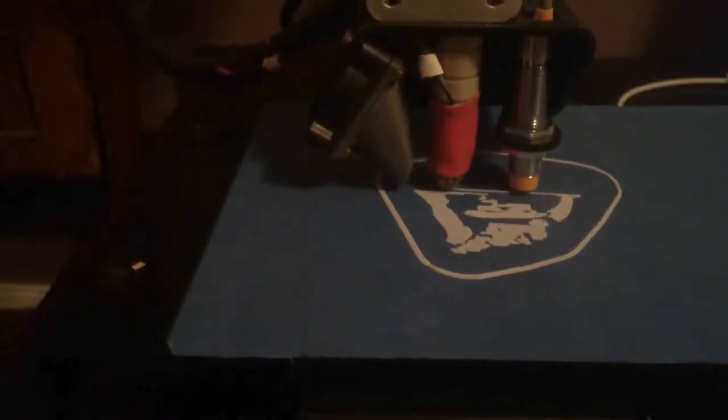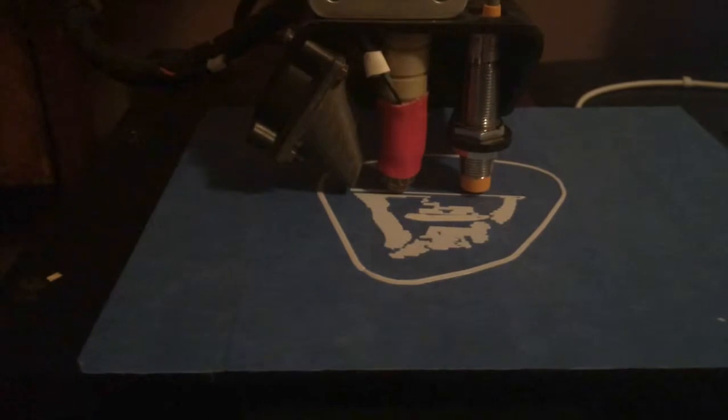After reinstalling the print nozzle and recalibrating the auto leveling bed, I started a print and it's looking very nice, very clean. Everything seems to be sticking to the print platform, which is good. And the computer says 12 hours, but then again, I am at 65% speed. And I plan on bringing it up to 100 once a good solid base is created.